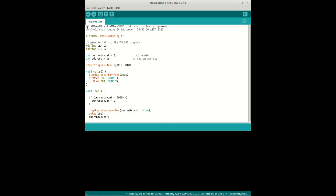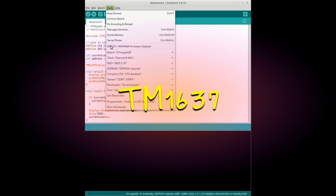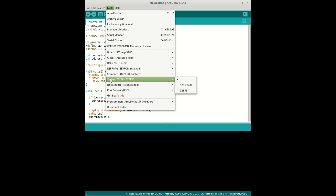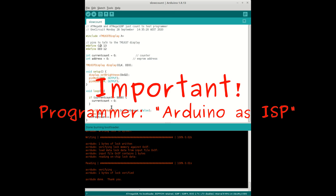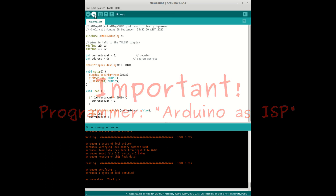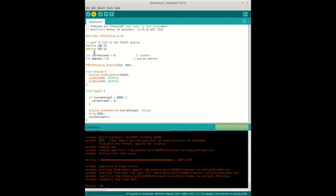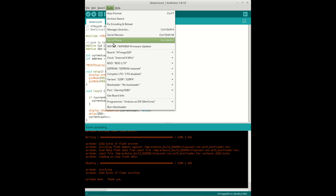This is the test program I'm going to use - basically a seven-segment display with four positions to measure temperature. I've got that program up and running; it's just counting at this stage, not measuring anything. With the 328 selected, I'll first burn the bootloader using the internal 8MHz option, then compile and upload the sketch via the AVR ISP shield directly to the chip.